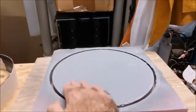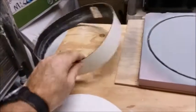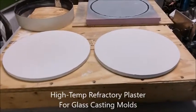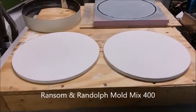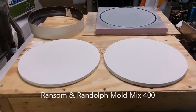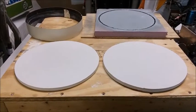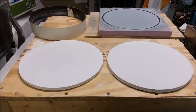It's hard to tell, but this actually has quite a concave dish to it. I use this as a dam around it, pour plaster in it, and — voila — I get slumping molds. These are F3 slumping molds for 10-inch mirrors. I'm going to start out small, work the kinks out of slumping, and build up to something bigger. I've already stuck my toe in slumping a little bit, but I'm really going to get into it now. My kilns are going to be really busy slumping and melting glass in a few months.